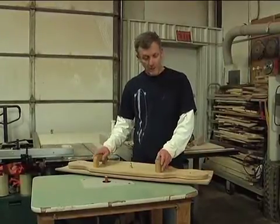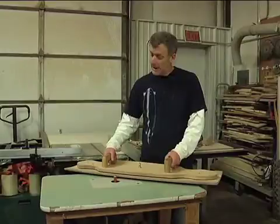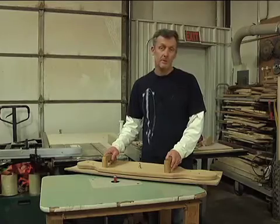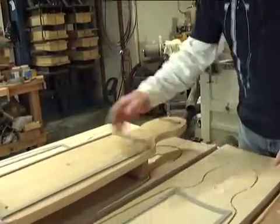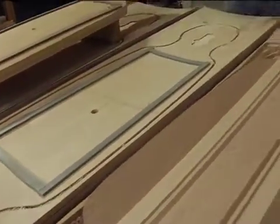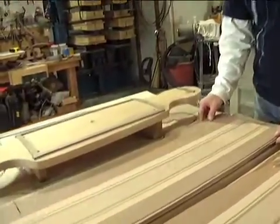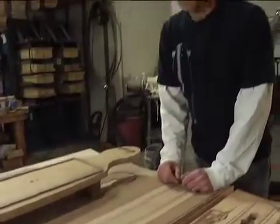All those steps are eliminated with the CNC. No tracing, no pre-cutting, no having to hold the template with your hands and possibly being exposed to the cutter heads. Basically, we have the same thing here, just upside down. We've got our seal on our fixture. We've got a vacuum attachment where we can attach our blank. Now we don't have to trace, we don't have to pre-cut, we just set our blank on our fixture, draw the vacuum on it, pull up the program in the router, and we'll have our board.